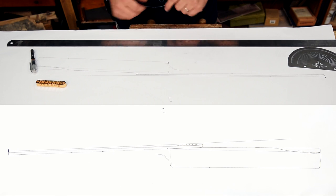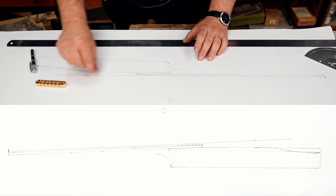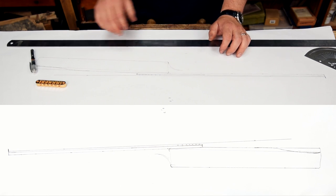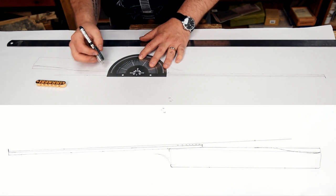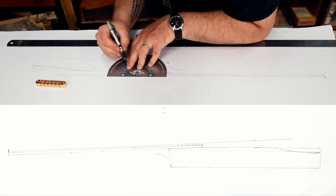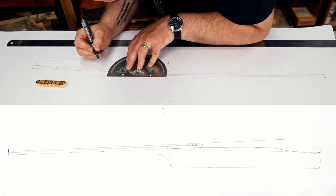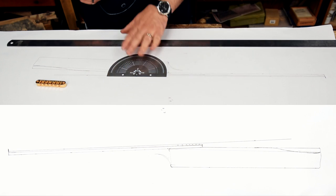That there will then be transferred over to your neck blank, and you just say okay, 18mm, and you're done — or make a template and draw that on. So what is the actual angle here, out of interest? I've actually ended up with — I've been saying three and a half a lot. We're at three. Yeah, three degrees. There we go.